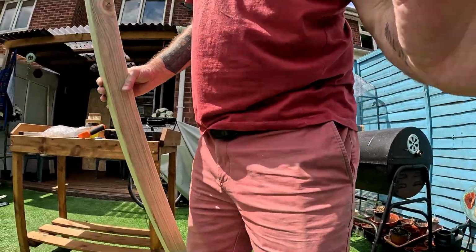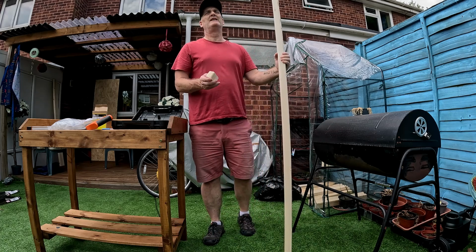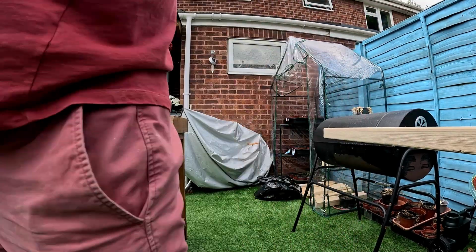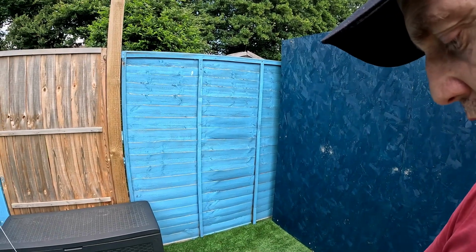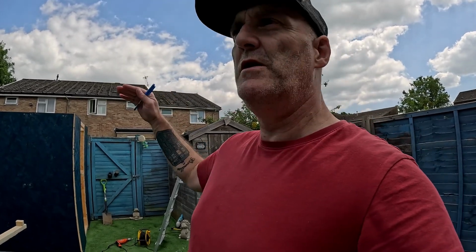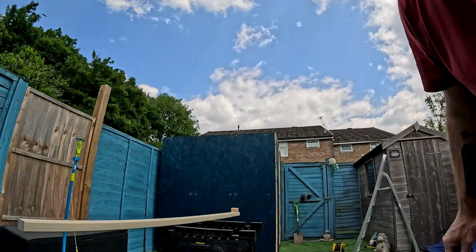Let me take you with me. Sorry about this. So, just sit you there for a minute. Obviously some of the little blocks that I'm getting rid of, I'm going to use one of them. So we know that goes flat on the wood going across, because we saw how we did that. We're trying to show you. So what I'm going to do now is literally, because that's how it would be flat on the wood, as you've got one either side, if I make one block, two blocks and mark it, then that'd be how much I need to take off. Then I'll do the same with another one, because I'm only going to put two up to hold the plastic. I don't need more than that because I did a trim around the top, so I'll just put two in the middle, more to support it than anything else. So I'm going to crack on with that, and you can just watch me do this for five minutes.